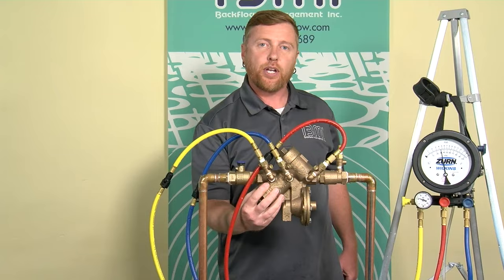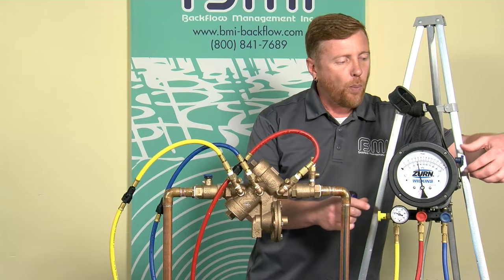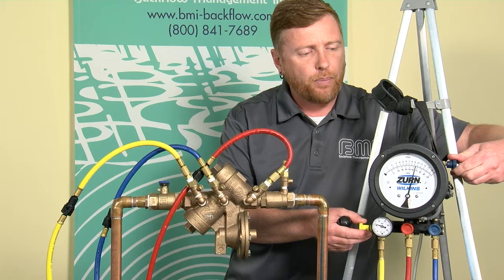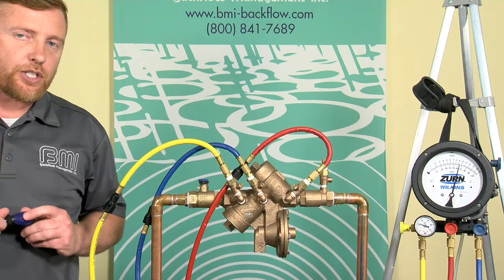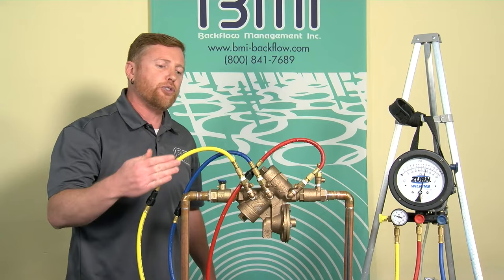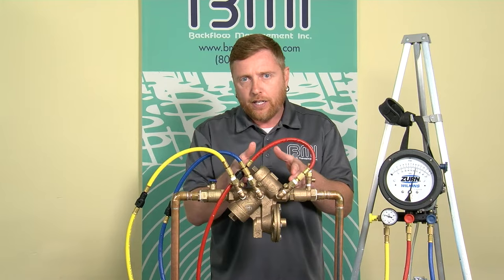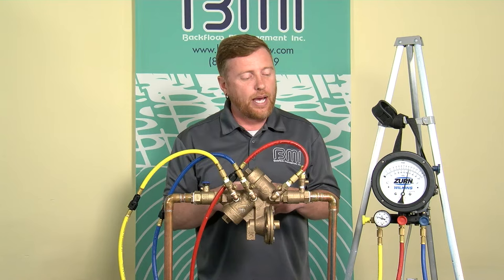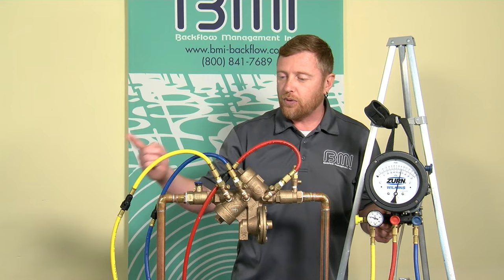Now I have a clear pathway to back pressure check valve number two. But before I do that, I'm going to open my low bleed needle valve to re-establish the pressure differential across check valve one, since I had just altered that value. I opened the low bleed needle valve long enough for my gauge needle to rise above the apparent pressure differential. Now I'm ready to back pressure check valve two. We're still observing the pressure differential across check valve one — we're going to introduce high pressure behind check valve two and observe how it affects that reading. If the gauge needle remains above the relief valve opening point, check valve two can be considered tight. Opening the bypass control needle valve transfers the pressure behind check valve two.